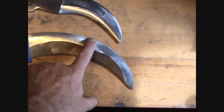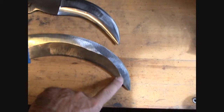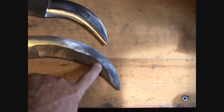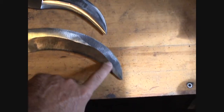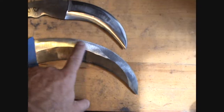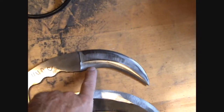I started doing the flat grind on top, and then I'm going to do a convex on the bottom. It's going to have this very crooked, sloppy line, only because my technique is not good enough yet to make nice, clean grind marks when I do a flat grind freehand. But if I do a convex down here, and then clean up the top with a convex, I end up with a fairly good knife like this one up here.